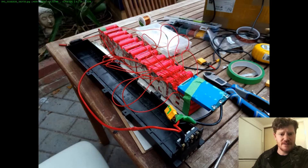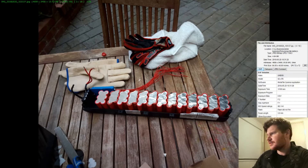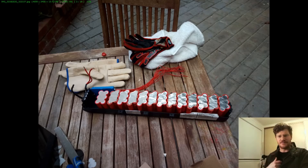It's quite a handy battery — it really uses the space well, filling up the whole space. I think it weighed just under five kilograms when I shipped it out. This battery gives over 20 amp hours of storage, and because it's a 48-volt battery, by my calculations that's 979 watt hours. From my rough calculations and testing on my previous bikes, I think with this bike we'd easily get over 100 kilometres — if not more like 150 to 200 kilometres of riding distance on a flat road just cruising along. Probably under 100 if you're pushing it hard, but because this bike is meant for cruising and touring, 100 to 200 kilometres depending on your weight and riding style is a fair call.